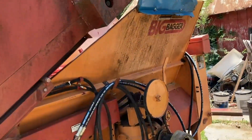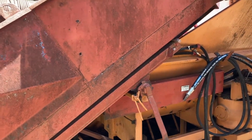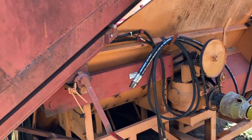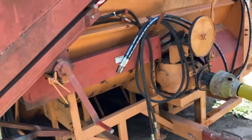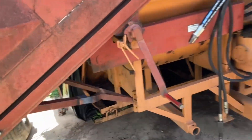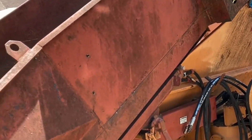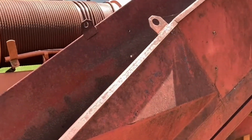We should be ready to put some haylage through her. We bought it probably eight or ten years ago. We had to replace the rotor bearing one time — that was a big deal — and other than that you can see this conveyor got hit and bent, so I straightened that out and re-bolted it on. Just a bunch of stuff that got neglected, so it's been a couple days messing around with it and now we should be ready to go.